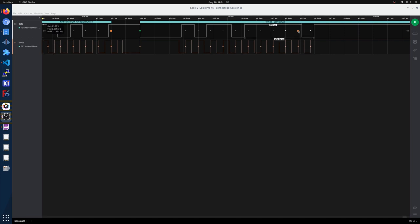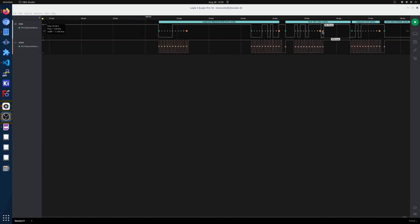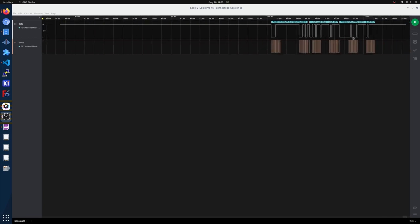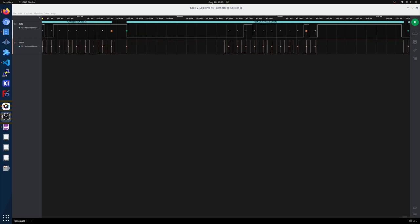Once you've toggled your stop bit, just turn the GPIO into input to allow the keyboard to acknowledge it and you should be good. At least specific commands will have an acknowledgement from the keyboard.